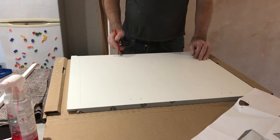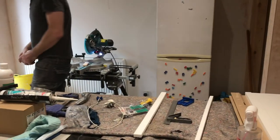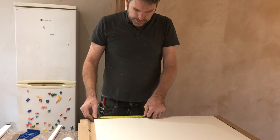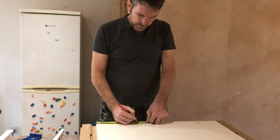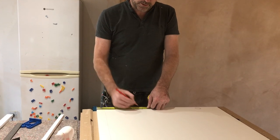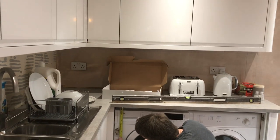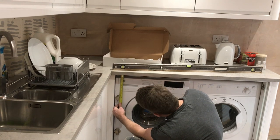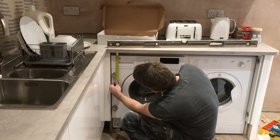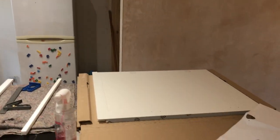There we have it — we've got the side of the door. Now before I do the door, I'm going to get my tape measure and measure to the centre of the hole. I put a mark on my tape measure and all I do is go over to the door and put it there — centre, centre — so you know where you're drilling. This door is going to be banging. That hinge has got a little bit of play to move it down or up. So we know when I drill this door it's going to be bang on.